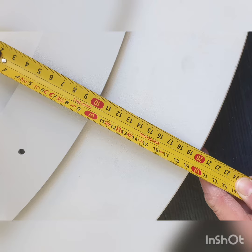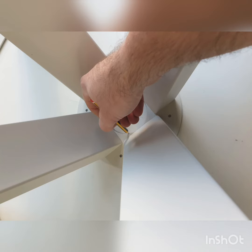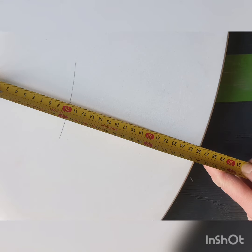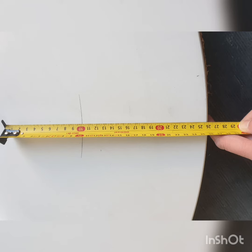Then, being very careful not to move the frame, I marked with a pencil at the centre circle as well as the inside of the outer circle, to ensure there are no marks left where they may be visible at a later stage. These are going to be my reference lines for once I've put my adhesive on — to know where to put the table top back down.